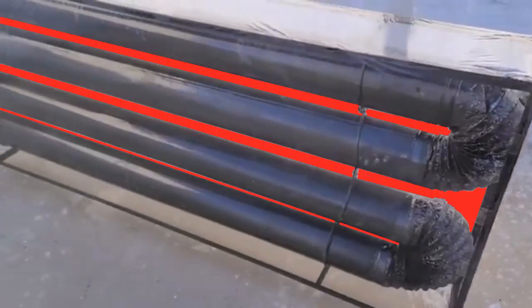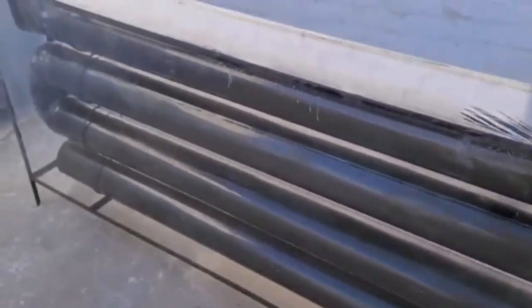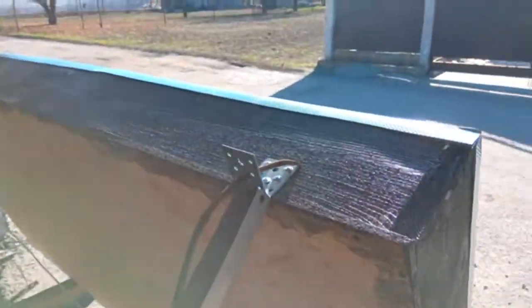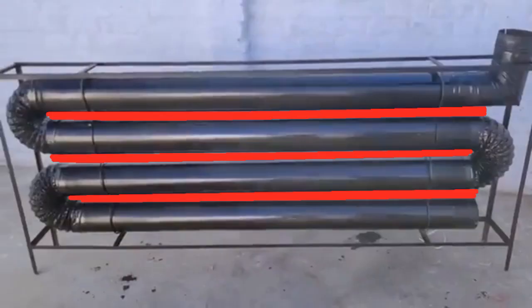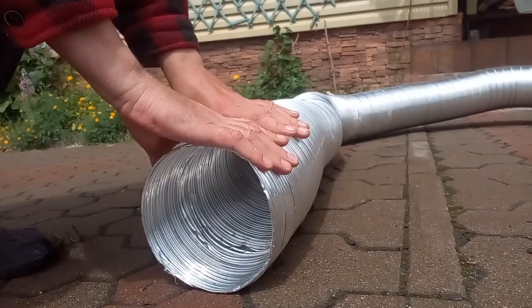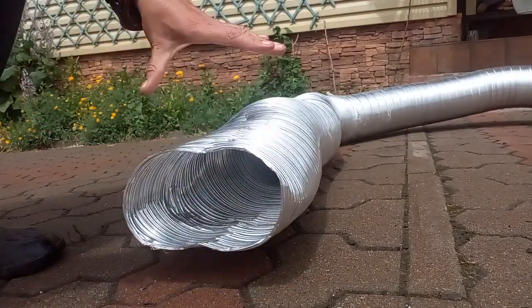On the north side we have to install a layer of thermal insulation with a thickness of 5 or 10 cm, as in similar solar heaters. The empty spaces between the pipes should be several times smaller, or we should make the shape of the pipes more oval.